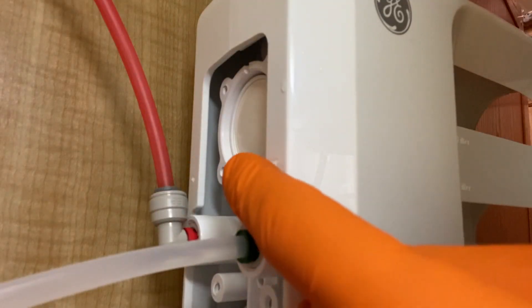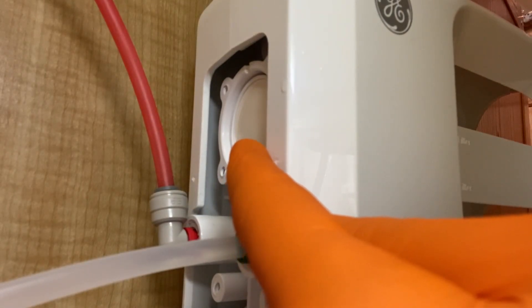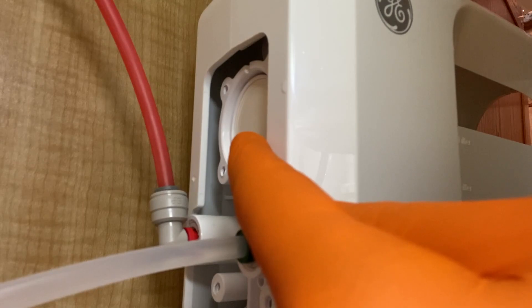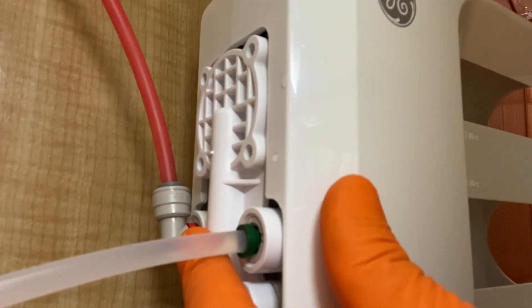When reinstalling the auto shutoff kit, just line up the actual portion here with the diaphragm and holes. You are screwing into plastic thread — do not cross-thread these screws and do not over-tighten. The upper four screws have washers and the lower two screws have no washers. Now it's time to secure with the screws.